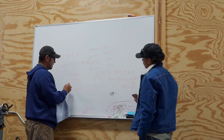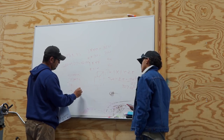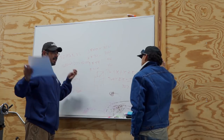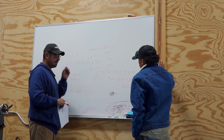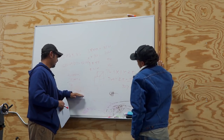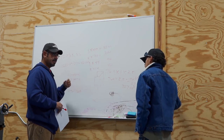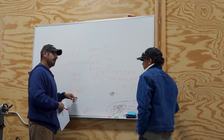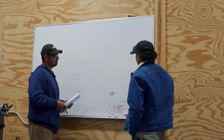So we're going to call the concrete company and tell them we need 100 plus — we need 110, right? So we're going to order 100 plus for this job. The reason you do that is you don't want them to send all 110 at once — they're not going to anyway because they don't have enough trucks. However, you're going to tell them 100 plus just in case it takes 105. As you're pouring concrete, you're doing math to see how it's advancing, and when you get to about 80 or 90 yards you start getting an idea of how much you're going to need. You may say, bump it up to 110, and I'll call you for a kicker. And that's really that simple.